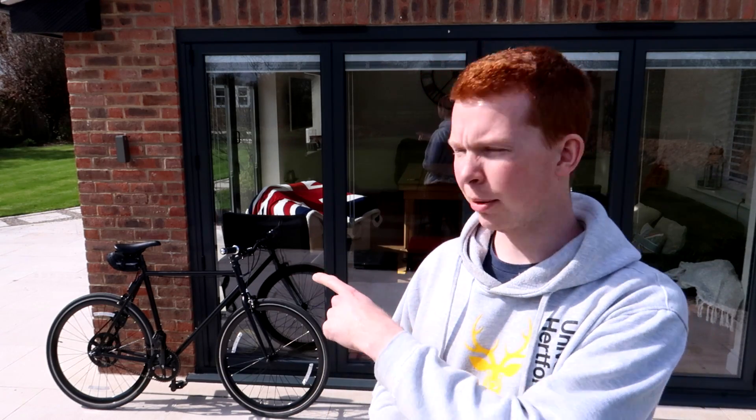Can you ride this e-bike in the rain? You can ride it in the rain — that's why I designed the electronics box which the speed controller and the Arduino chip fit into. However, the box alone is not waterproof. I took it out for a ride, went through a puddle, and the water squirted up from the back wheel and went straight into the box through one of the gaps. It didn't do any permanent damage — it just made the speed controller freak out for a couple of hours, but as soon as it dried out it was fine.